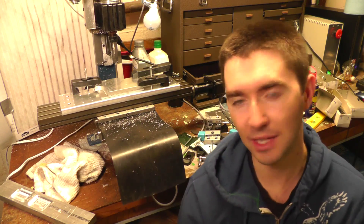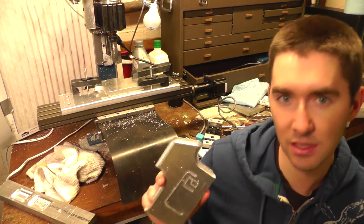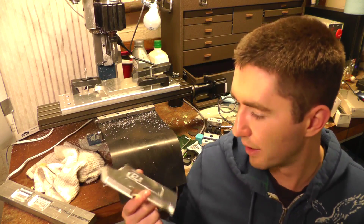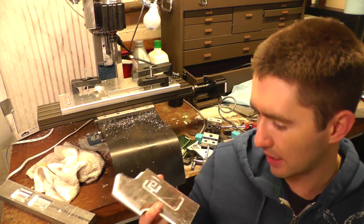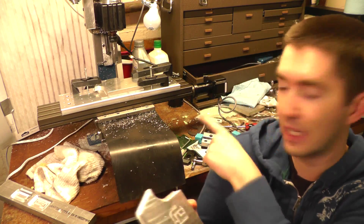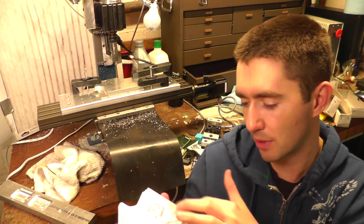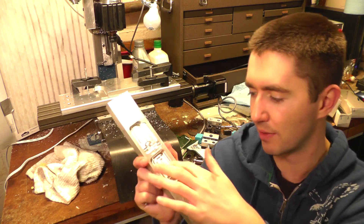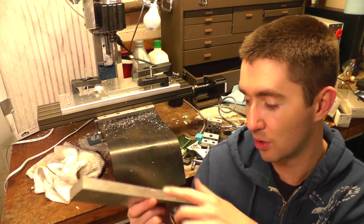Actually cutting the shape out of the edge of metal. This is some scrap aluminum that I got from Maker Gear. Rick was nice enough to let me add his scrap. When you're cutting out the outline, you need to do one of two things: you either need to clamp it down or have it in a vise and cut around it, where you're not cutting down into the center but cutting on the outside and utilizing what was in the center. The difference being that you go all the way down through the material.